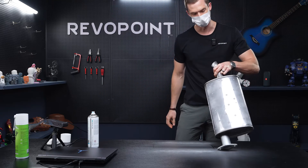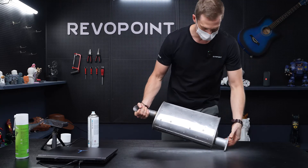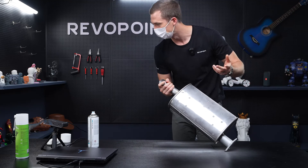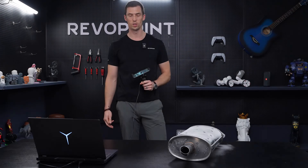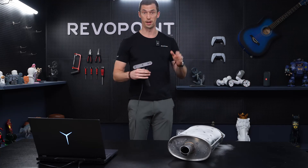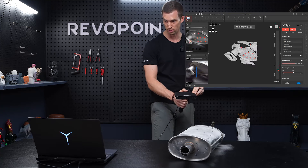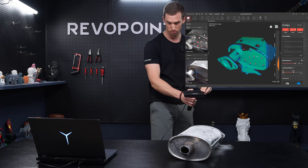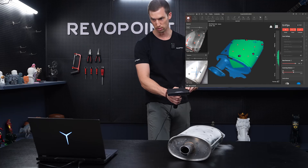You can see it suddenly gradually becoming more solid. Now when we go back and scan it, it's going to be a world of difference. As you can see, the markers are now covered, so now would be the better time to add some marker dots if you need to. We just got done spraying the muffler — it's nicely and evenly covered with scanning spray. Check out the result: you remember at first we couldn't find anything, none of the point clouds were captured. It really is a world of difference.